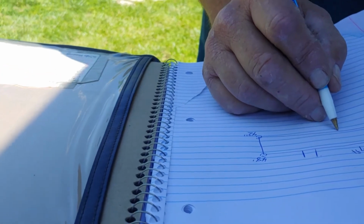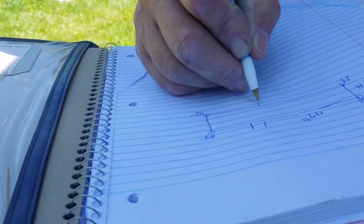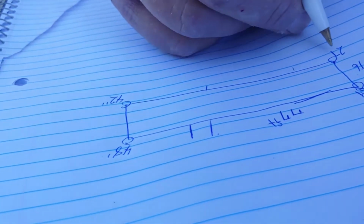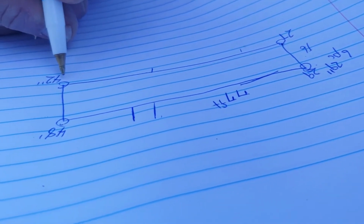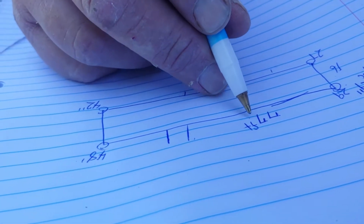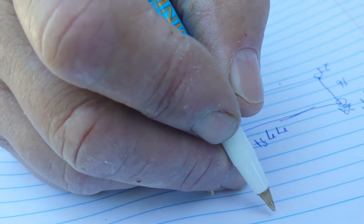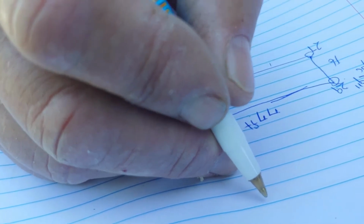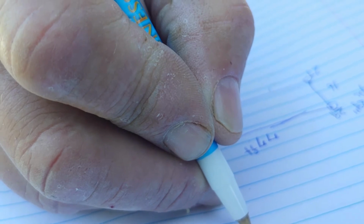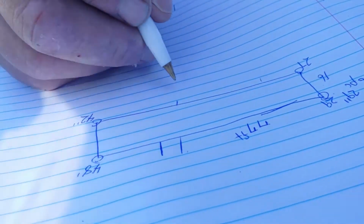from here to here, we'll go about. And then you can change that because you might end up with some big drops in the middle of your house. You need to measure those. But let's say it's getting smaller from here to here. Let's go, this is 77 feet. 77 divided by 3 would be 25. That'd be 26 pieces per side.